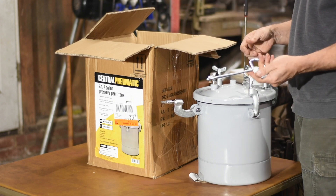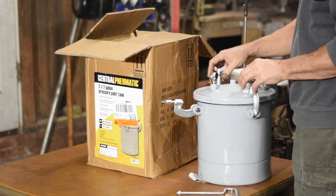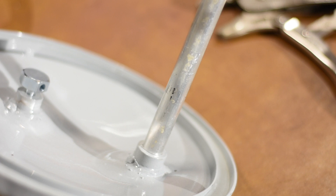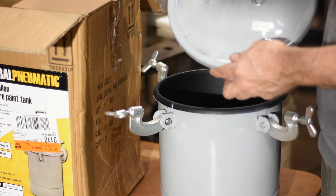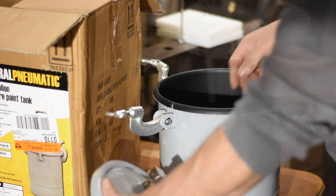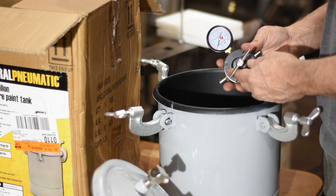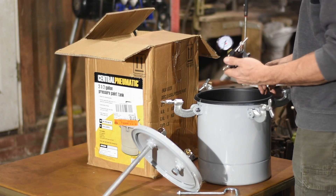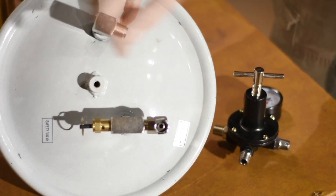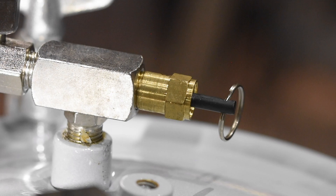Here's the pot. It's a very robust chunk of metal, theoretically rated for 60 pounds per square inch of pressure. The top secures with these hold-downs. Inside it has a silicone gasket — which may well have been made by a four-year-old — and the top has a couple of fittings for air and paint to go in and out, and a siphon for sucking out the paint. Also a regulator which regulates the pressure of the air. We're just pushing in air — nothing coming out — so we don't need the siphon or that second connection. Finally, there's a pop-off valve: basically an emergency valve so the pot won't blow up if you crank the regulator too far.